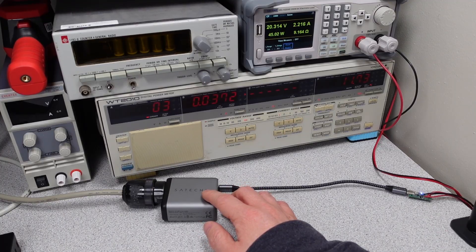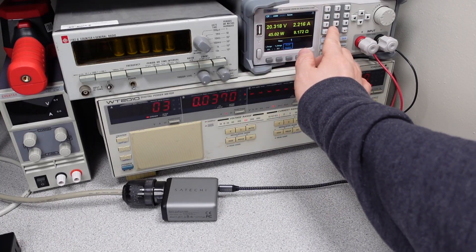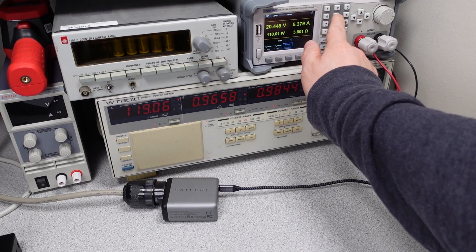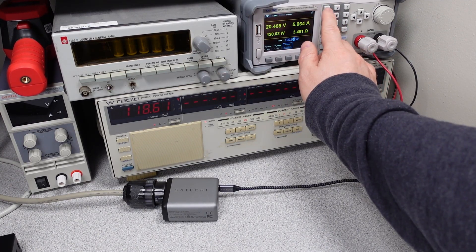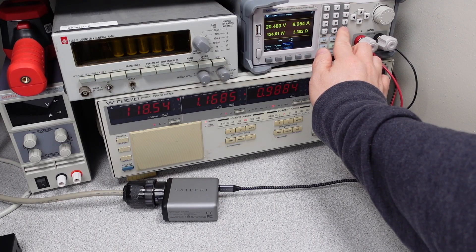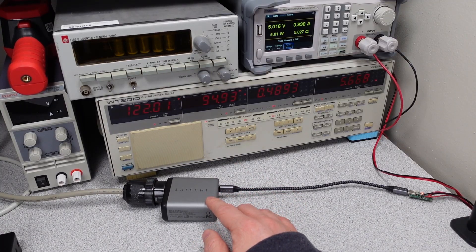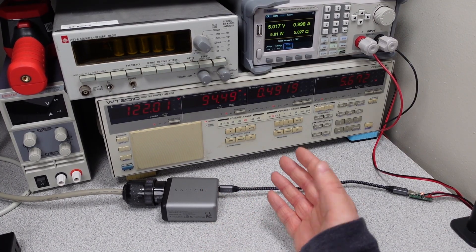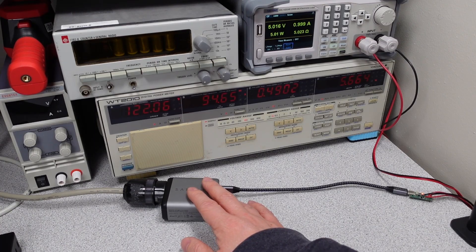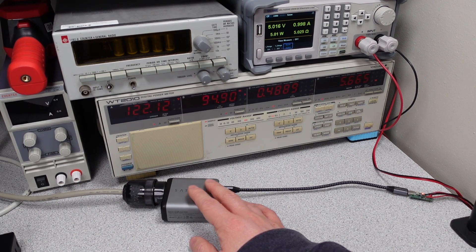That limited PFC activation is a big downfall for the power quality of this unit. Keeping it in the 20-volt mode, let's take it up to overload and see what it can do. Going right to 100 watts — that's the full rated load — no problem. Stepping up: 110, 115, 120, 122, 123, 124, 125 watts — and it trips out. The device recovered back to 5 volts. Delivering 125 watts is a little on the high side for the 100-watt USB specification, but some people might think of that as a feature — the device can actually deliver a little beyond its rated capacity before overload protection kicks in at 125 watts.